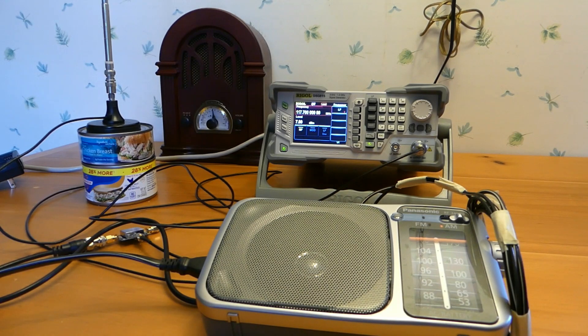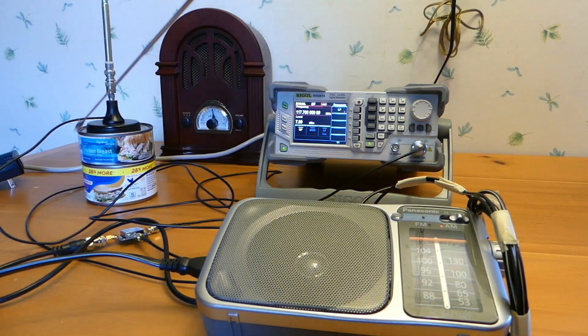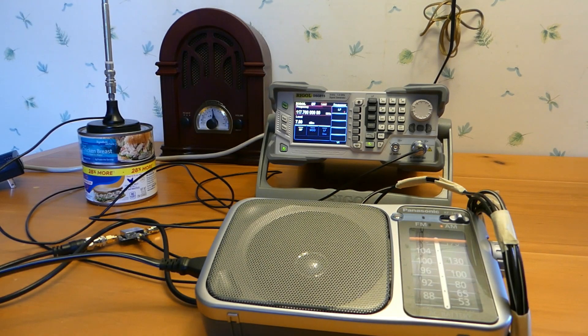So I thought you'd like to see that in operation. And this here — the VHF antenna — it's picking everything up. And we're down-converting the signal and coupling it with this loop right there. So it's picking up signals from the airport pretty good. Again, the mixer — Alpha Delta Echo Dash 6. It's a nice little project, and it really makes you see how receivers work, and how we do down-conversion and up-conversion.